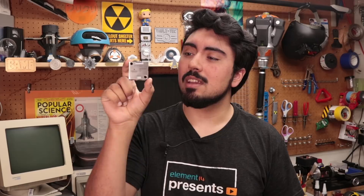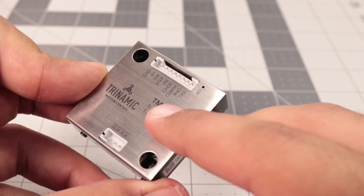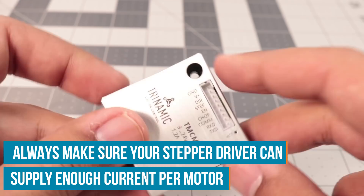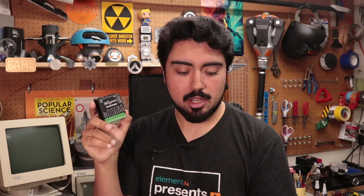You can't just supply power to the coils of a stepper motor and make it go — you've got to do it in the right way. So in this case I'm using the Trinamic TM-CM 1070, which has more than enough oomph to drive our stepper motor. It has the basic step and direction interface, as well as a UART for doing some more advanced current control settings. In order to drive the blade mechanism, I'm using a rather beefy NEMA 23 motor that has a fair amount of torque, and a suitably large stepper driver will be required to drive it — to provide the torque for actually cutting insulation and cutting the wire.